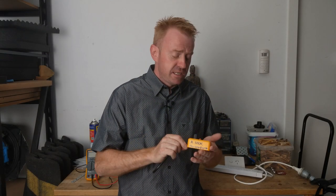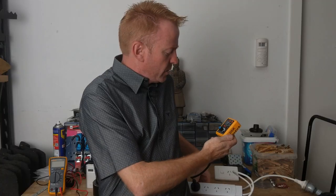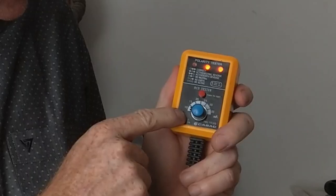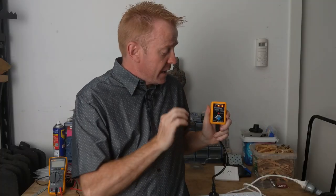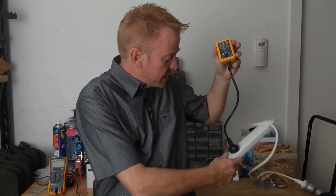Let's put this thing through its paces. I always start with it set to minimum, then press the test button. At 10 milliamps I'm hoping it doesn't fire. Nothing happened — and that's good. If it tripped at 10 milliamps when I go to start up an HMI, the RCD would get a false trip because the capacitors in the HMI ballast will have a 10 milliamp loss momentarily, and the safety switch would read that as a possible electrocution and turn the system off.